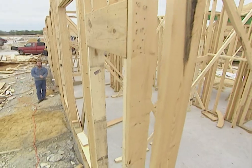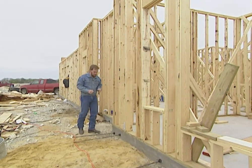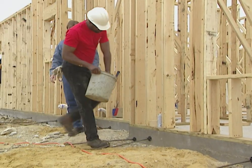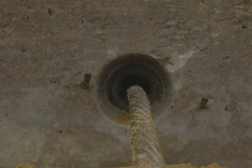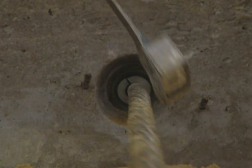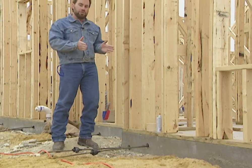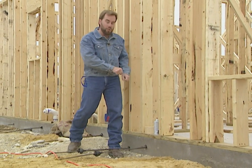It's been exactly seven days, and our concrete has hardened up enough that we can go ahead and stress it and put tension on our cables. First, we remove the plastic on the cable end and put in wedges so the cable won't back in. Bobby from Post Tension and Steel pulls the black piece off, then sticks wedges down both sides — little pieces of metal that keep the cable from backing into the foundation once tension is applied. The cable moves about one inch for every 12 feet. This foundation is about 45 feet across, so we'll have approximately three and a half inches of movement once we put tension on it.